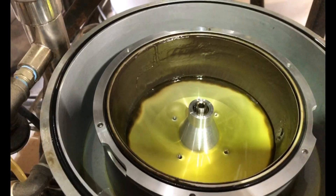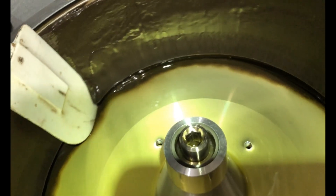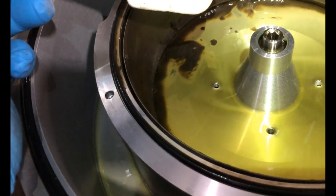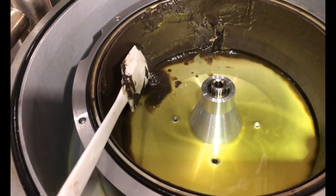Here's a look inside the centrifuge bowl where this stuff collects. I ran about 500 gallons of oil through it, and what you get inside is this peanut butter consistency stuff, which is the heavier residues of the oil. The water also spins out in a wall around the outside. When you shut it off, there are these little holes that it drains back down. If you didn't settle it for a few months first, you probably wouldn't go 100 gallons without having to clean this.